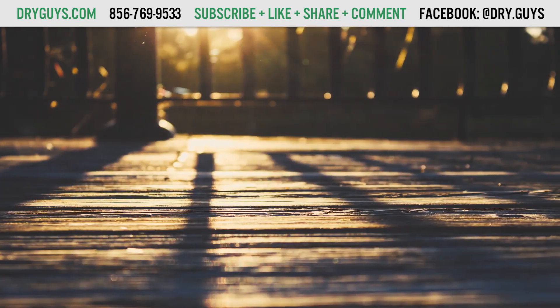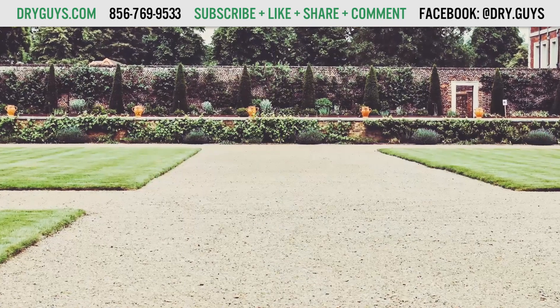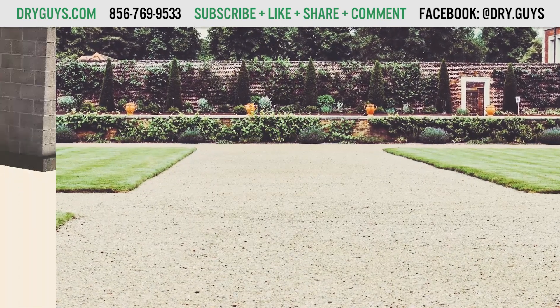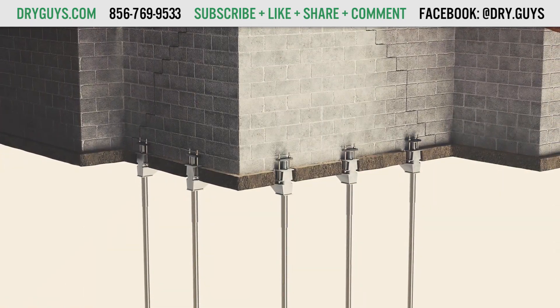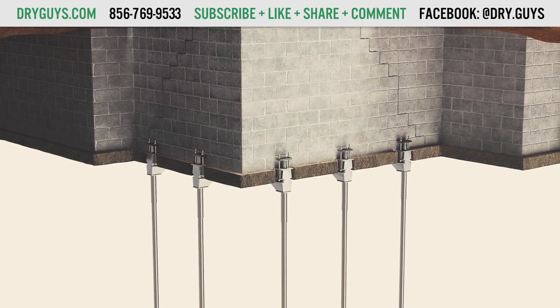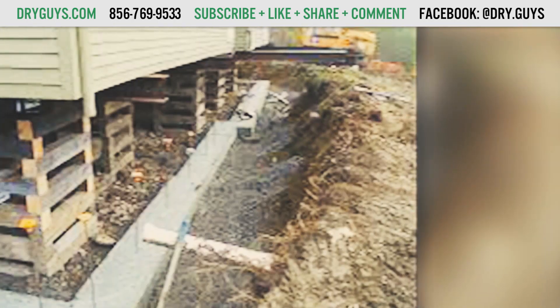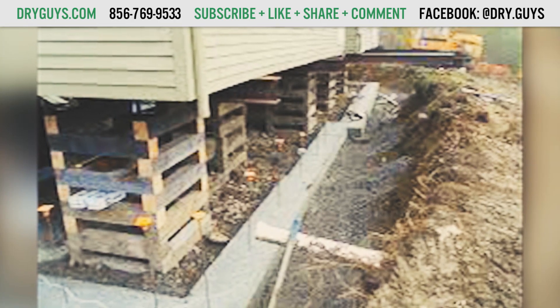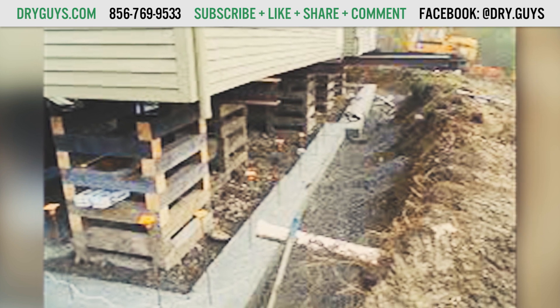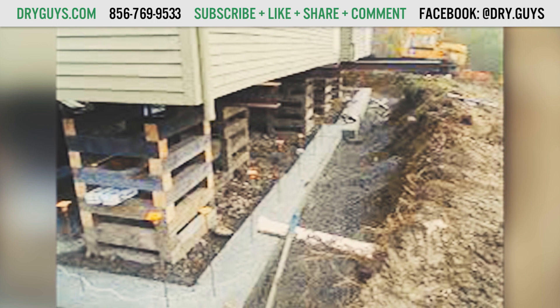Additionally, it requires the removal of decks, patios, entryways, and shrubbery. That is not a concern with push piers. Since push piers rarely require a soil boring sample, this makes the installation relatively quicker as well. Pro number 6: You generally don't have to replace your foundation. Our push piers system allows you to fix the one you already have, so that such a drastic measure doesn't usually have to be taken. Pro number 7: Push piers can be installed both indoors and outdoors. It doesn't require heavy equipment, and this makes it ideal for relatively tight spaces where such equipment can't be used.